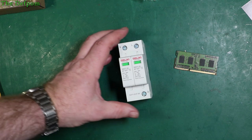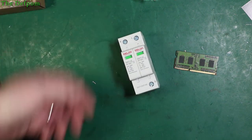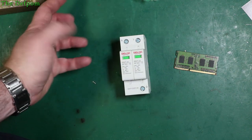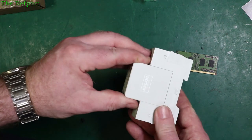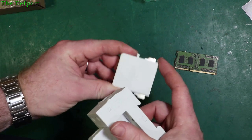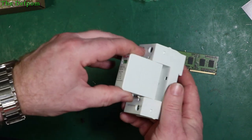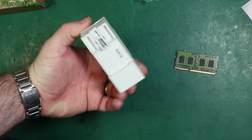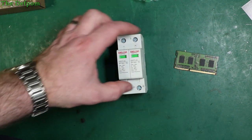It is a surge protection device. So you stick this on the main circuit breaker box. This goes across live and neutral, and Earth as well — it's surge protection. So these actually protect your entire electrical system from surges. These are like plug-in modules. You've got these connections there, so if they do blow, you replace the module itself without having to do any rewiring or replace the whole unit. These are supposed to protect across live and neutral.